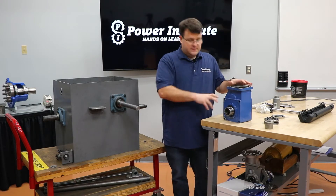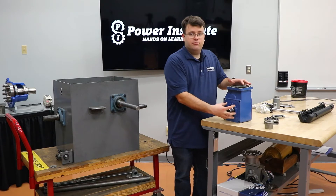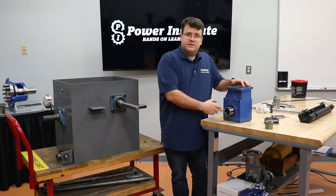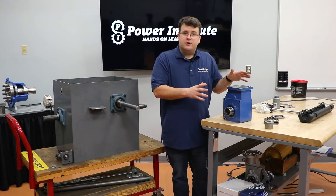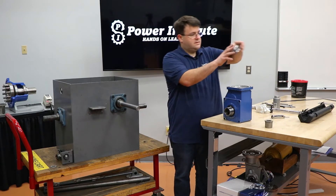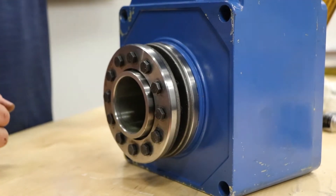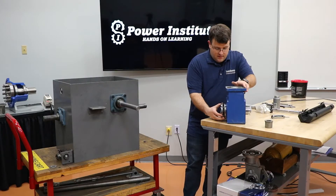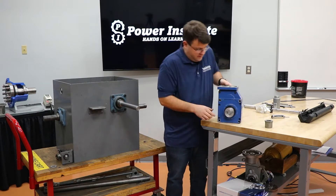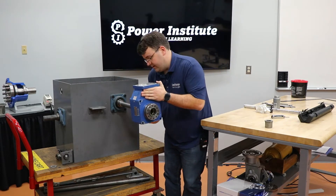Now for the front — for this demonstration we will not have a safety guard on it, but the first step would be to mount the rear safety guard plate that attaches with the two Phillips head screws that it comes with. We won't have the guard on here just so you can see how it goes together. We'll go ahead and grab the shrink disc itself, slide that over the bore, and sit it all the way up against there. Now we can go ahead and put it on the shaft — flip it around and slide it onto the shaft.